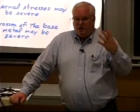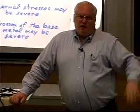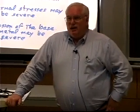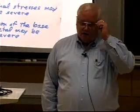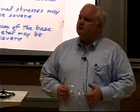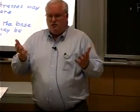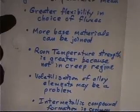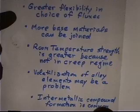And so these people basically had a fastening technique in their patent, and we were looking at patents back from the 1830s where people were making eyeglass frames. And it turns out there's certain types of things that can't be brazed or soldered that are ceramics, and they tend to be things like abalone shell or tortoise shell, or, what are some of the other things? Some of the thermosetting plastics can't be brazed because these things decompose at the brazing temperature. So if the base material decomposes, obviously you can't braze it. But virtually any material that doesn't decompose, you can find a flux and a solder material or a brazing material that will flow across the surface.